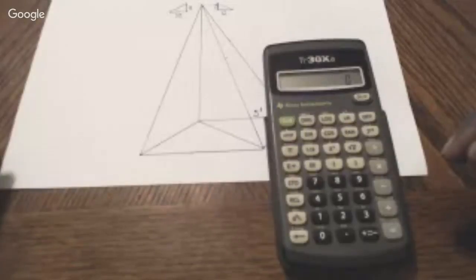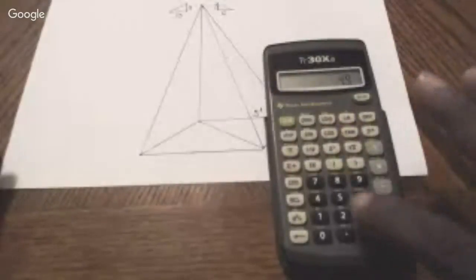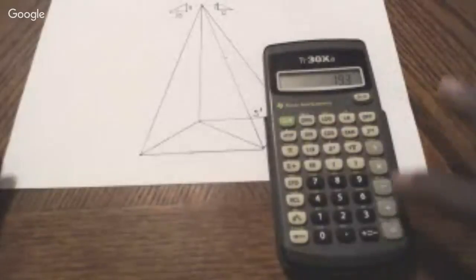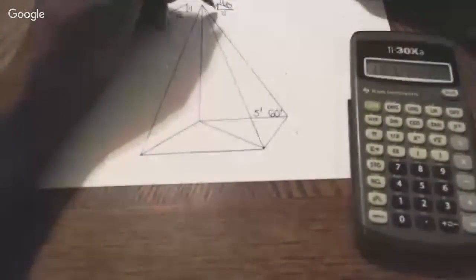Now, we need to know what the hypotenuse for a 7/12 is. And we'll show you how to do that on a calculator. And you can see my calculator is in reverse too. So you put 7 squared, plus 12 squared, equals, and then square root: 13.89. 13.89. That's your unit for every 7/12 run. 7/12 segment, it's going to be 13.89.